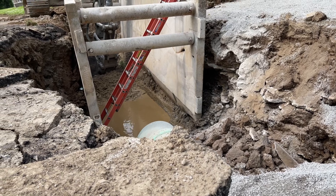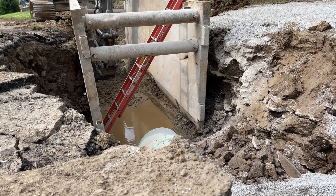In construction, you have excavation of pits and you have excavation of trenches, which normally is below the ground water table and also floods during the time of storm water events and it has to be dewatered. The dewatering of that creates sediment and you cannot discharge that sediment directly to the stream, so therefore you have to do some type of treatment.